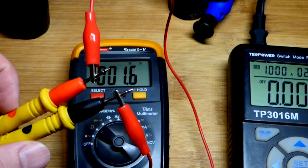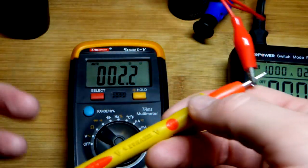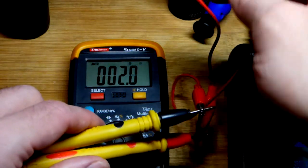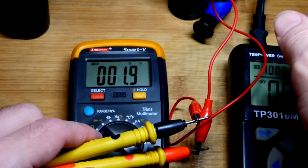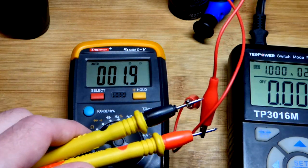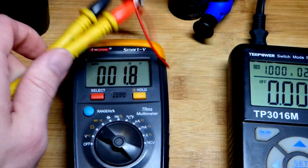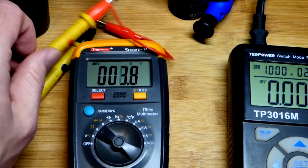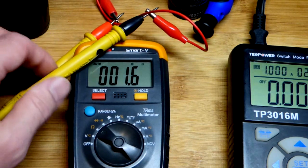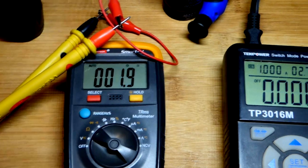You can see we got 1.6 ohms, and that's actually low right now — if the wire is moved it's going to go up. You could see three ohms for a bit, and there we go, about two ohms right there. Best case scenario I might get like one and a half to two ohms depending on how the alligator clips are positioned. It can get a lot worse — I held one position and saw six, then like 14 ohms. Especially with movement it's really going bad.